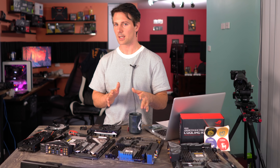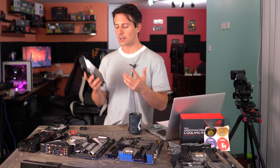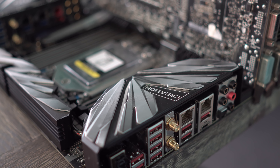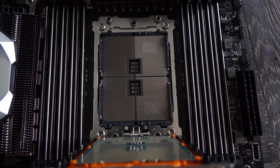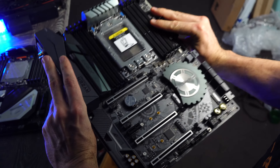Before I go, some critiquing points. MSI includes this graphics card-looking NVMe cooling solution with four sockets you can plug into a PCIe 16X slot, giving you four NVMe options. But instead of including things like this, I'd like them to spend that money on a better VRM implementation — maybe a fin design so the heatsink doesn't cut out after 10 minutes when overclocking. The Taichi not cutting out after 10 minutes is in ways a slight victory, coming in at considerably less money.